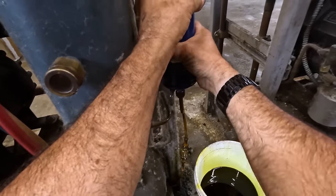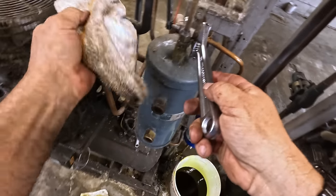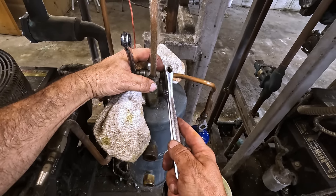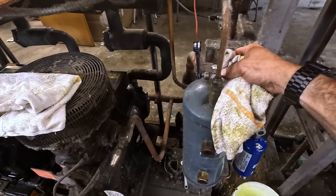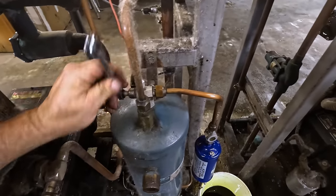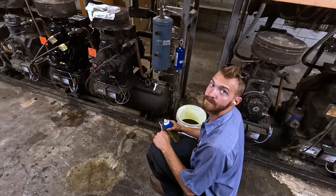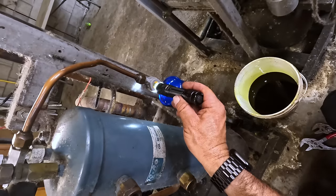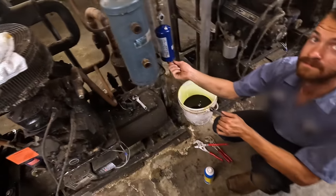Hopefully there's a copper ring up in there. Bleeding through. You could try to pull a vacuum on it - bleeding just like a leaky hose. That way we don't leave oil all over and you'll know if it's a new oil leak. I wonder if we got problems with the oil separator - unless we got a ton of oil one or the other. It looks like oil but maybe that's refrigerant. We should blow some out - see the blue mark here.